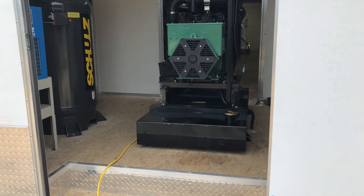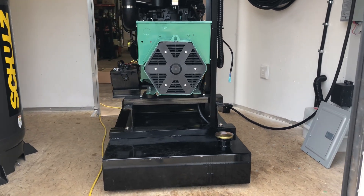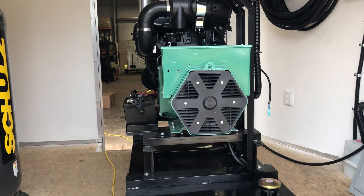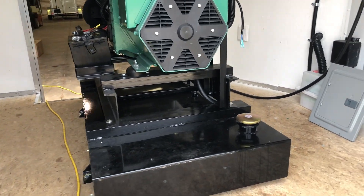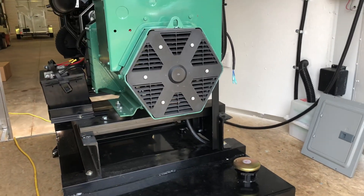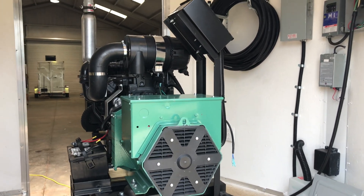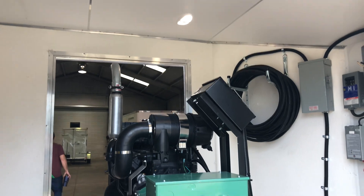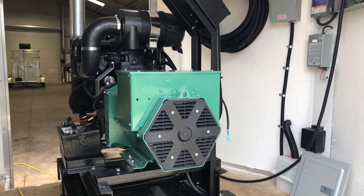Here we go — we're going to give you a tour of what we put together in this trailer. First thing you see sitting between these double doors is a 30 kW single phase John Deere generator. It has a 50-gallon base fuel tank on it. Pull up to the fuel tank, you can fill it up right here. Pretty simple setup — we like to try to keep things simple. The customer is going to do his own exhaust out through the roof.